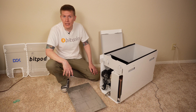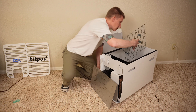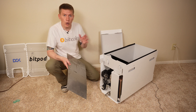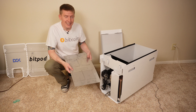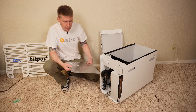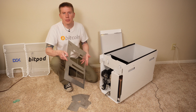The package comes with a two-piece flow plate design, consisting of a stainless steel plate and a metal wire mesh with some ports welded to it. It's pretty easy to install — just set the wire mesh in the bottom of the tank. The steel plate is an optional piece of equipment; the system will work without it. But it has cutouts matching the bottom of an S19 miner, which will block the flow around the miners and focus all the fluid flow up through them, maximizing your efficiency. These are mostly laser-cut — just wiggle them until all the insides pop out.